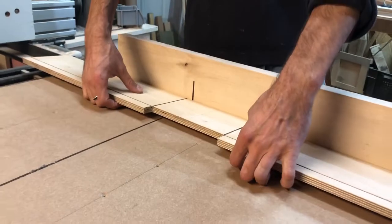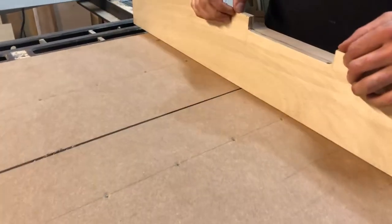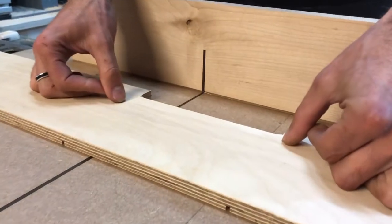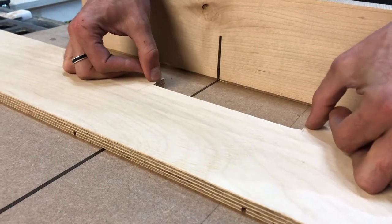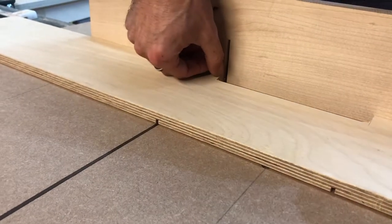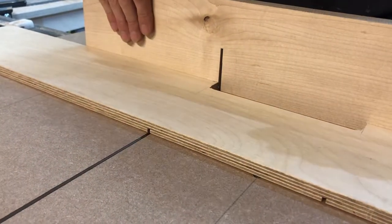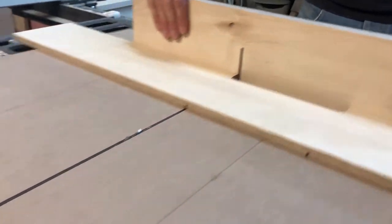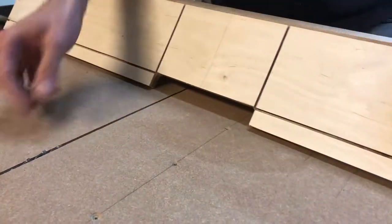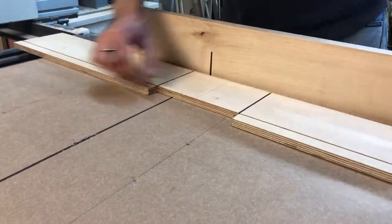Then the sled is handy for this — all you have to do is mark from the center line again. I put my center line here, measure up the left and right each side an equal distance. I line up my marked line just where the cut of the blade is and run it through with the sled. Do the same here on the right side of the blade — run it through with the blade just enough to score maybe a couple of millimeters, two or three mill inside — and then we end up with these lines.